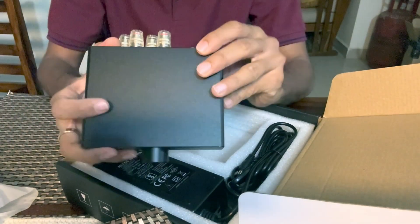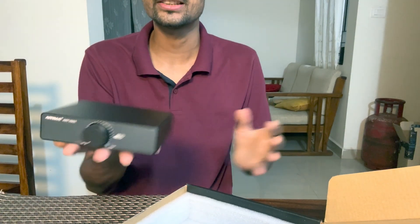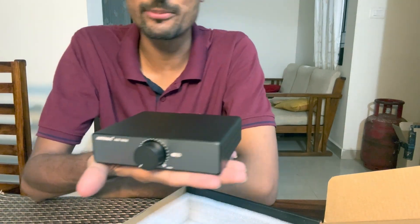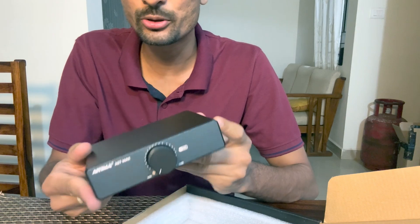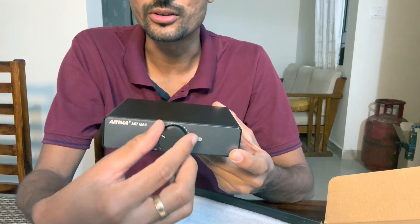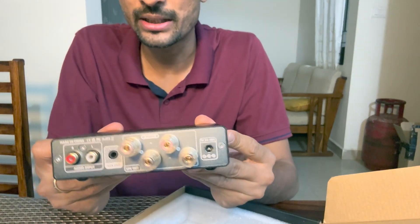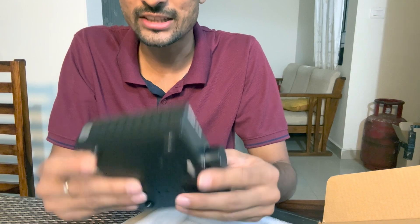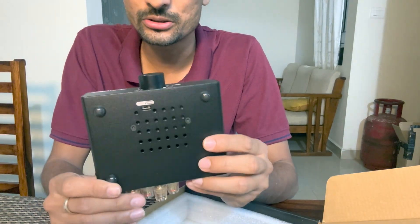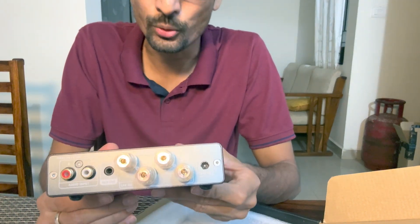You can see this is very well made and quite small — you can see the relative size of the palm of my hand. It's absolutely pure direct: no EQ, nothing. You have an on/off button and a volume control. On the rear you have banana plugs, and also understand that this is bridgeable — you can use the PBTL configuration to configure the output into mono.